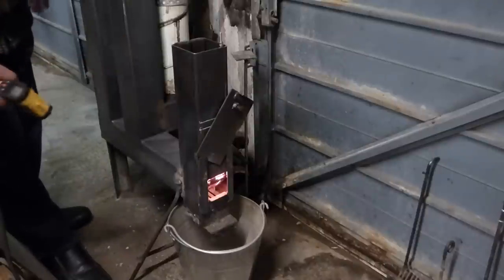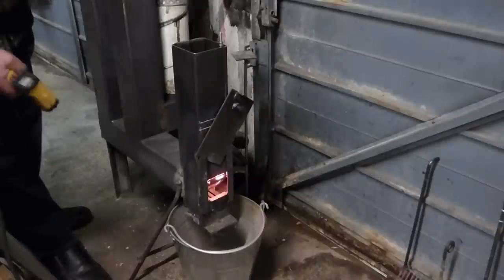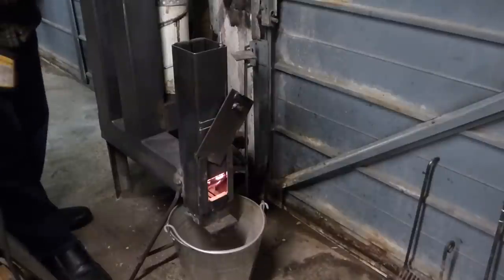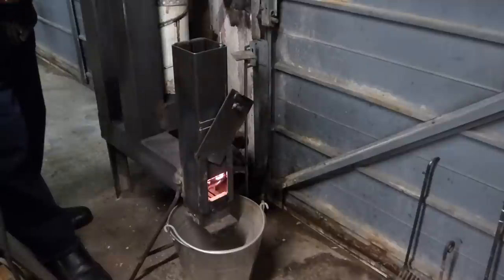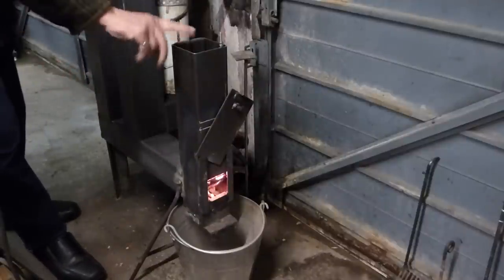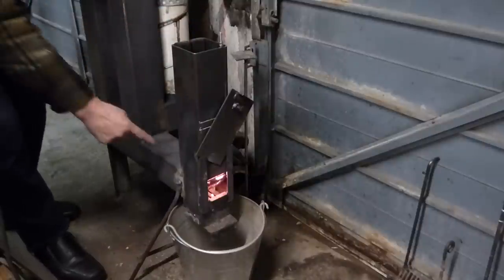It's nice to have a bit of this — it's a space heater, so this is not a boiler, this is not a rocket stove in the normal sense. It's a space heater — that's what I made, so it just heats here. If you have to work out the distances, whatever diameter that is, it's four times the diameter in the horizontal that gives you a good measurement.